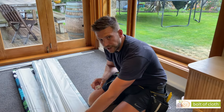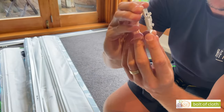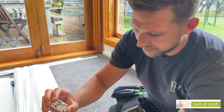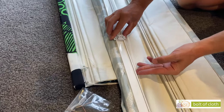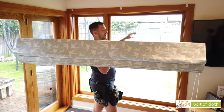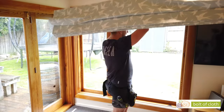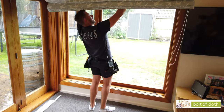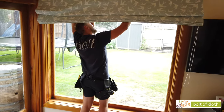With your revolutionary head rail, the brackets — as we've attached to the architrave already — are a spring-loaded system which have two claws: a top claw and a bottom claw. When installing the blind onto the bracket, it is an upwards motion which closes the clamp and clicks in. You can install the blind from here onto your brackets — it pays to slightly wind it down to give yourself some room behind the head rail. Then coming up and over, we're tilting the head rail away from the window on an angle, clicking the bottom part of the channel under the bottom claw.